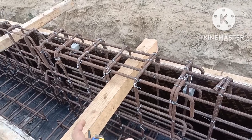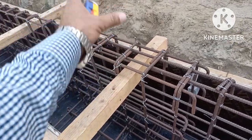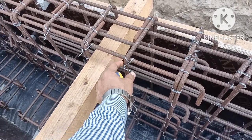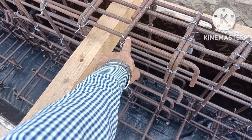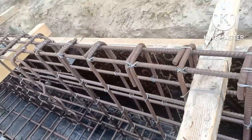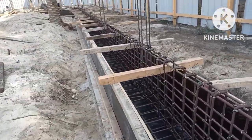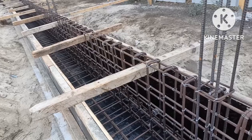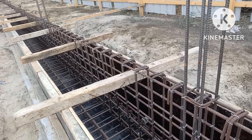This is the big column — the infill block will come on top of this. They tied it very well; you can see the binding wire. This is called a cross tie — an eight-figure tie. This is fine. Now we proceed further. There are small columns because this is the boundary wall and the chain link is coming on top, so here is the column 200mm by 200mm.